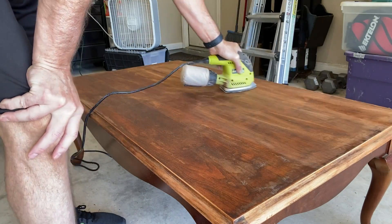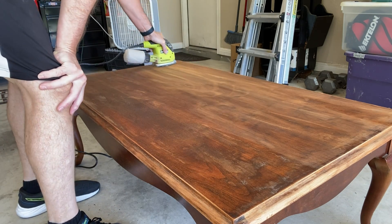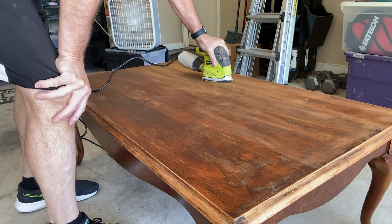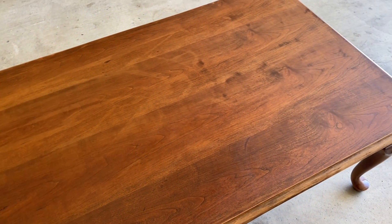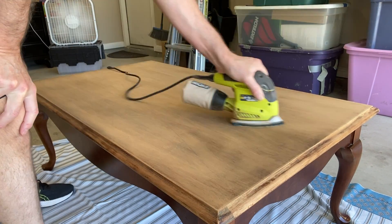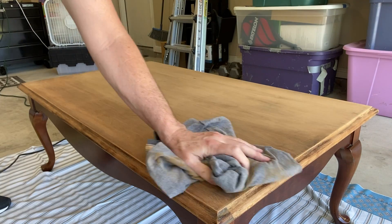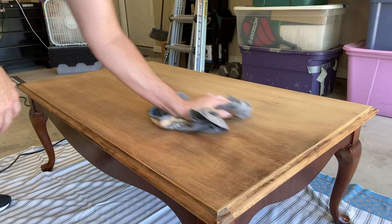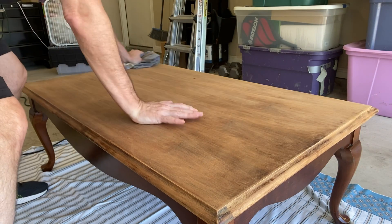Since the glue is off I can use the sander to minimize the contrast of the light and dark areas. After sanding it looks so much better - I like that color - but you can still see traces of that path. So I sanded more and more and got down to this really light color of the wood. Frankly I really like that color and wish it could stay like that, but I knew to make it look really authentic and beautiful I was going to have to put a stain on it.